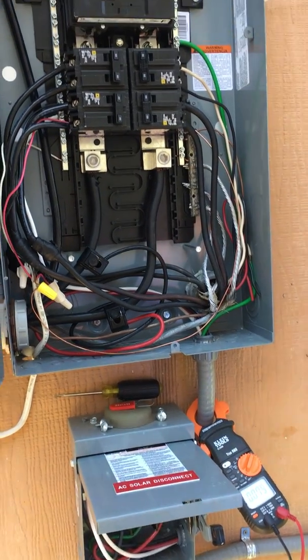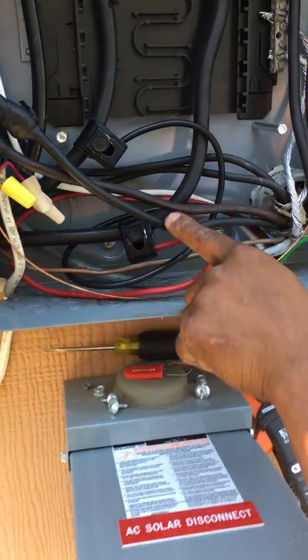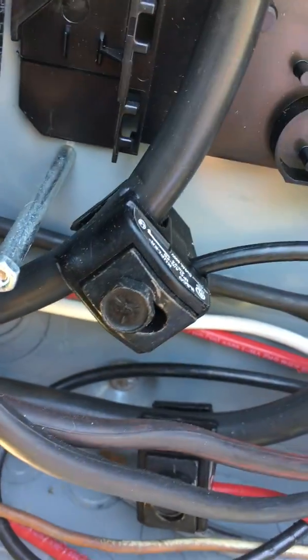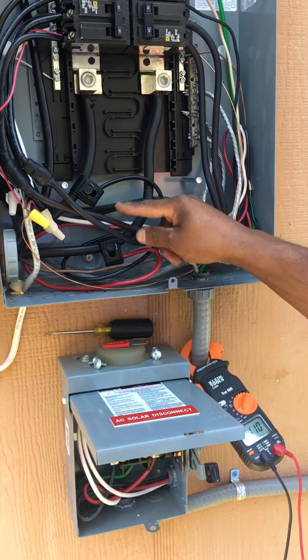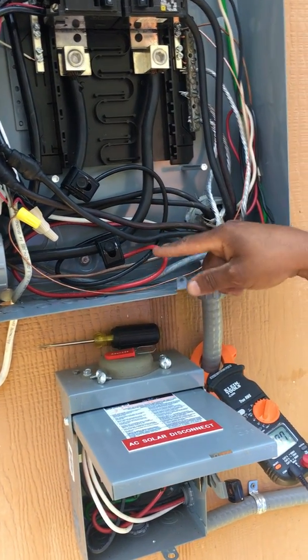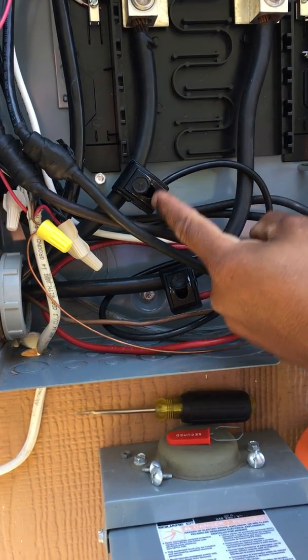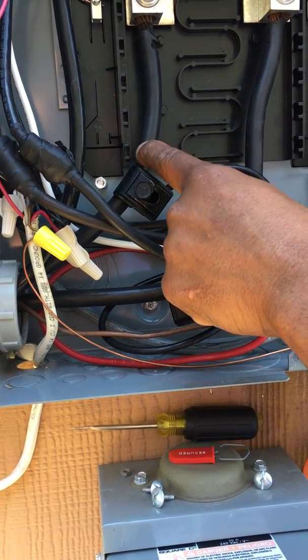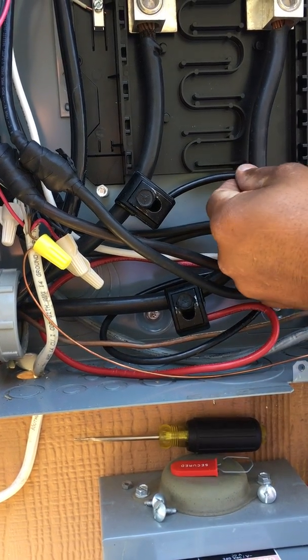The first thing we're doing is checking these taps to make sure they're actually connected to these service wires. We need to make sure that the wires from here are properly terminated inside of this slot. It's kind of like a shark bite — it chews down into the wire, and then it has two teeth on it to give us a connection.